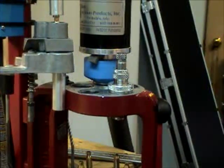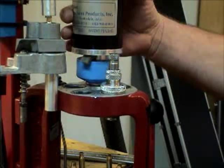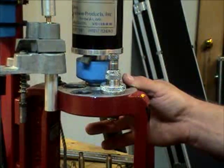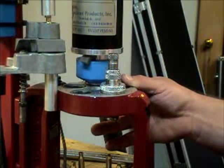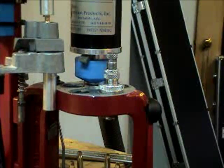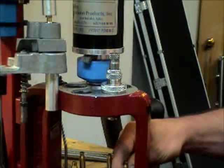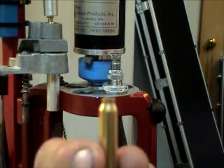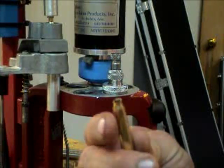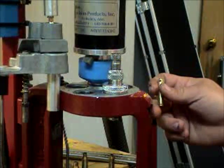Here I am set up to convert 223 brass to 6.5 PCC. I have the Dillon RT-1200 trimmer and a modified 223 die. Basically what I did is I took the die and put it in my drill press with a carbide bit. I had to recess the hole inside the die so I could trim the brass shorter, because when we trim it, we trim the brass neck down, and then we neck it up with the 6.5 PCC die, which expands the neck up and forms the rest of the case.